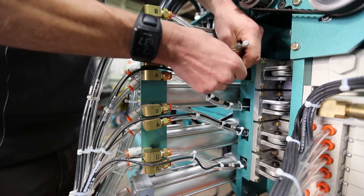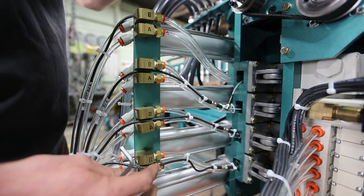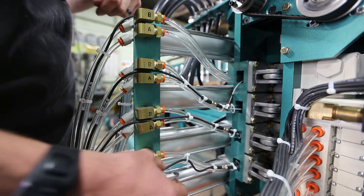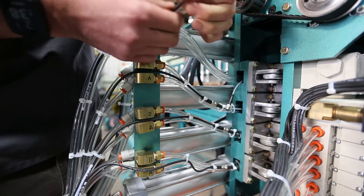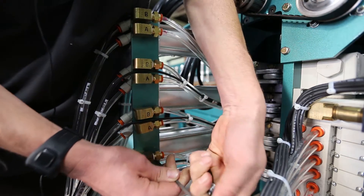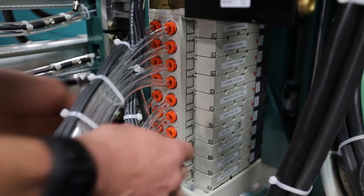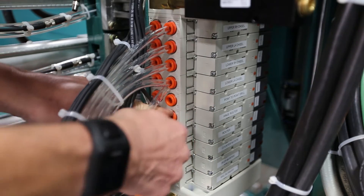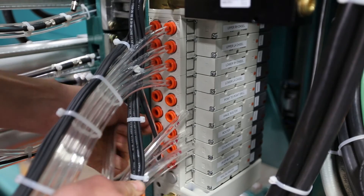If it's an older machine, you won't have an eye sensor on this cylinder, so don't worry about it. We're going to remove the bracket bank for the chisels. There are two flat heads behind each piece of brass. If you can't get your Allen wrench in there, you could push it out of the way. Using a 3/16ths Allen, remove the two bolts. This will remove the airlines from the cylinders — just let them hang. Now remove the airlines one through five that we already labeled by pushing the airline in and pulling out. Remove all the B's, then come in and remove the A's.